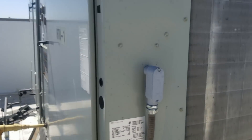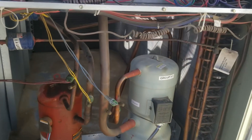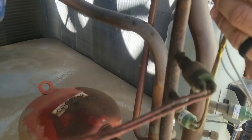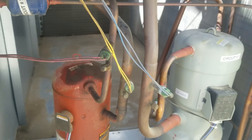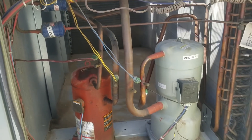Yeah, 180,000 BTU — so it's a 15-ton. Another thing: I had already opened this up and you can see there's a bunch of oil spray all over the pressure control and all over the head of the compressor. I'll have to look into that too — see if maybe we have a leak or if that's just spray from someone taking their gauges off.